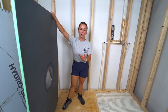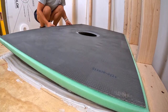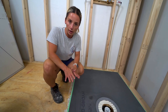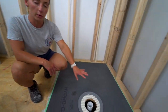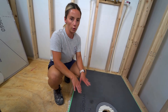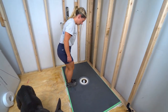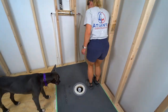Once your thinset is down, place your shower pan onto it. Before pressing it down for a strong bond, check around the walled perimeter to make sure the pan is exactly where you want it. Then step on the shower pan to collapse the ridges and get all the air out, knocking down those notches — start from the center and work your way out.